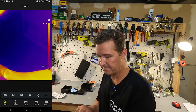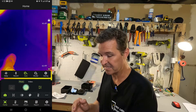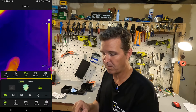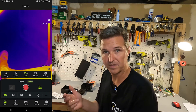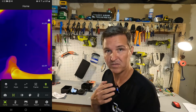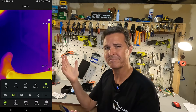Let's look at more features. At the bottom you can see a little camera icon — click on that and it brings up options to take photos or video. You can click on the slider bars and set a delay, do a voice recording, or adjust the shutter. There are more settings where you can take pictures continuously or put a watermark on your pictures. When you click video the button turns red and it starts recording the screen. The image icon to the right of the camera lets you choose how you want to find temperature measurement points.